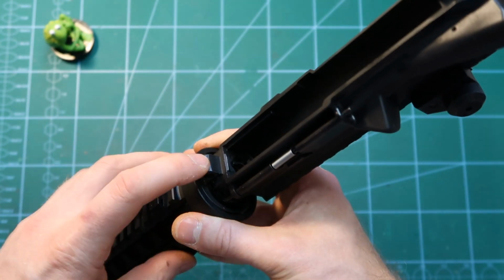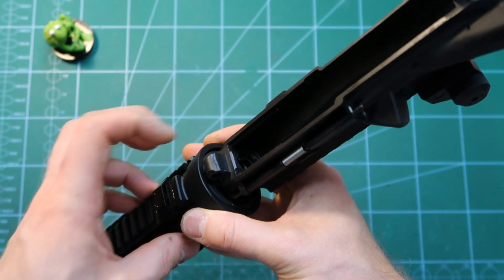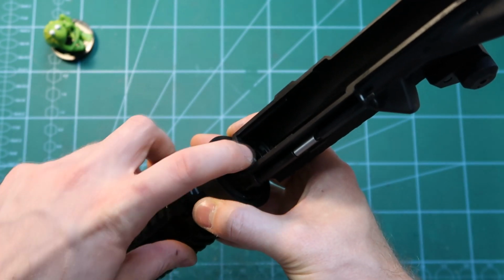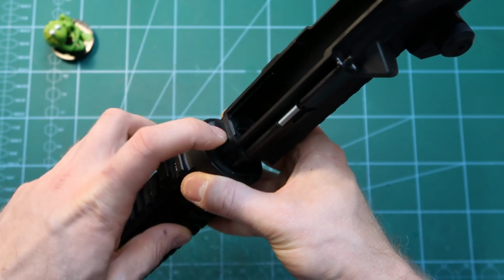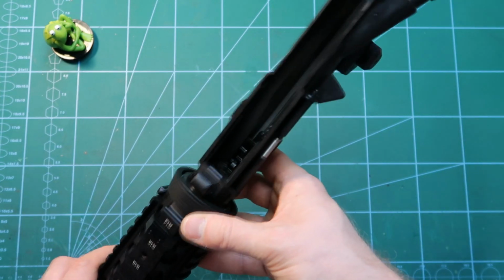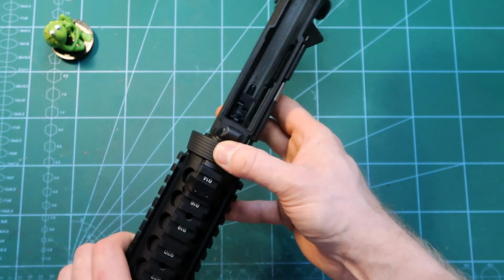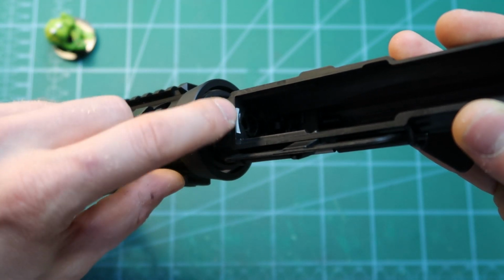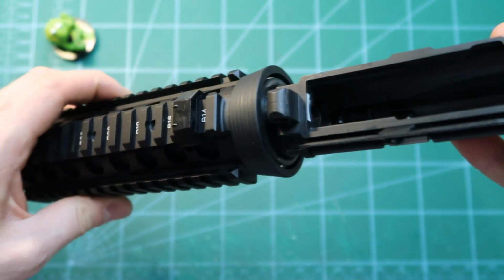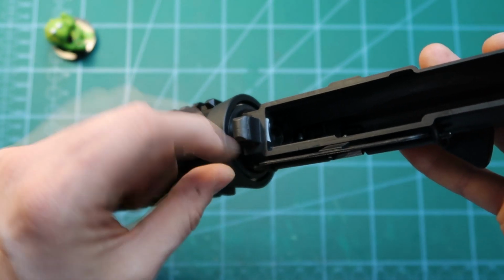And what we are talking about, the removal, is this part here. You see that there is this step with this chamfer that reflects the light right now, and we don't want it. We want this to be flush with the wall of the receiver next to it. You will see a bit better how it looks when I modify it, because it will be silver, and you will get the idea. So this silver beautiful surface here was that step. Now it's removed, and it's practically flush with the front wall here inside the receiver. It's probably like 0.1, 0.2 higher.